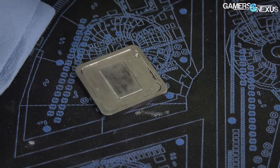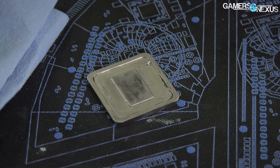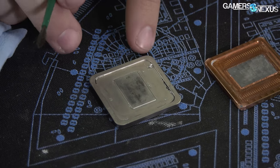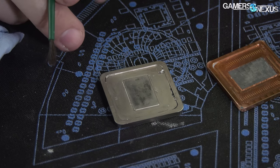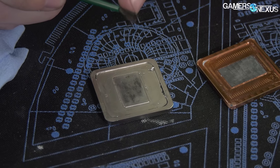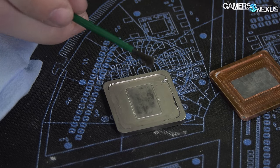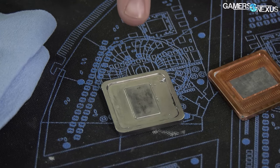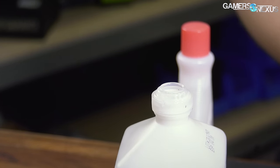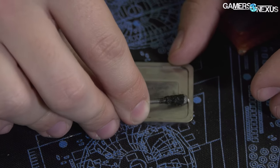You can also push a lot of the liquid metal over and technically reclaim it by siphoning it back up — though how useful it is at that point, we'd likely just use new material for testing. For working with cracks or small gaps, if liquid metal falls into a small socket or something, you can grab a brush — hobby brushes work great. These cleaning brushes will reach into sockets and pinholes and hopefully get some of it out, because otherwise it will cause an electrical short.